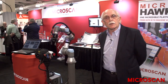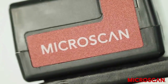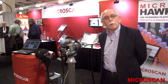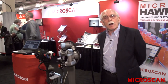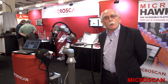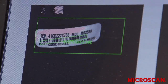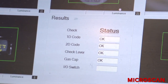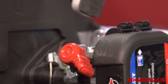Mounted on the robot is a Microscan MicroHawk subcompact machine vision smart camera. The smart camera is mounted close to the robot gripper and has been programmed to perform a number of different inspections. As the robot moves around the part, it first identifies it by reading a barcode and then a 2D barcode. It then performs inspections for the presence, absence, or the location of critical components.